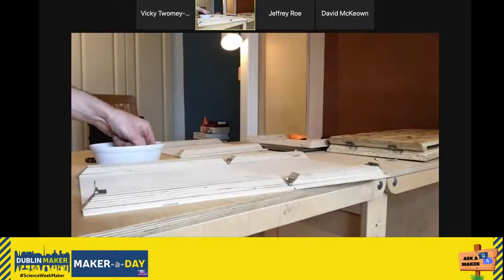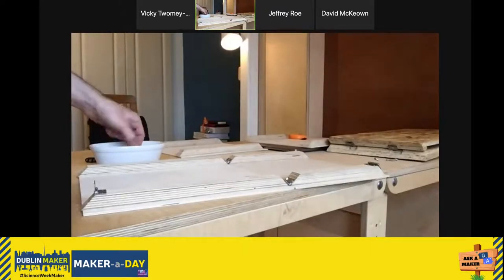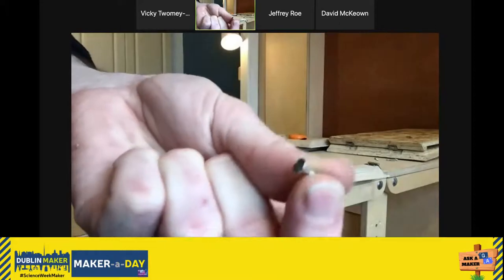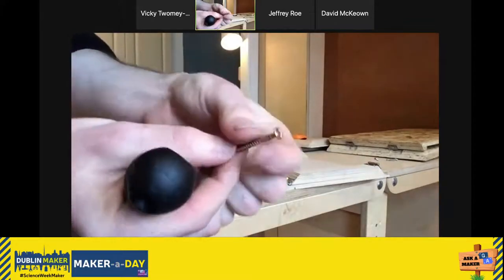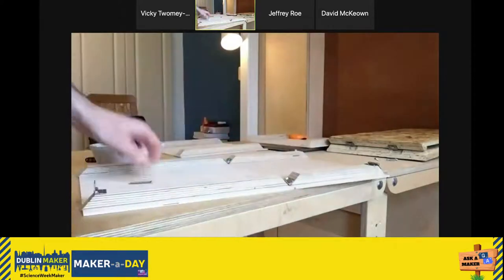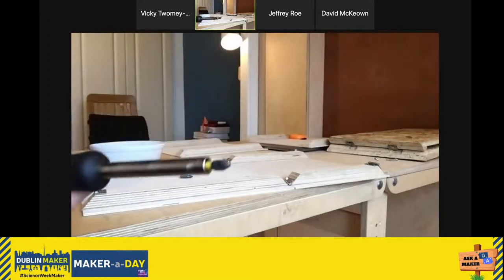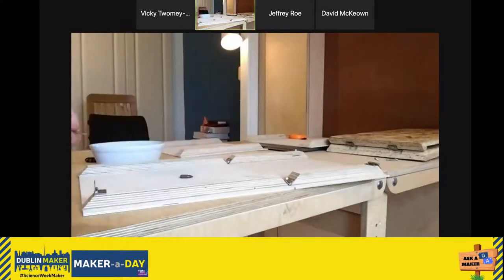So when you're dealing with this, a tip that I like to give people is, when you're dealing with very, very small screws, ones like these where they're so small, you can't really get any sort of grip. And they also have a Phillips head, which is hard to get a start in the screw. What you can do is get a long screw that has a Phillips head, which is a little bit easier to use, just to start the hole. And that we can do by setting up the screwdriver with the proper head. These screws have a large head, so they have a Pozidriv 2 head. This is a Pozidriv 2 driver. And this is important so you don't wreck the threads of the screw itself, or the tops of the heads. You've got to get those lined up.